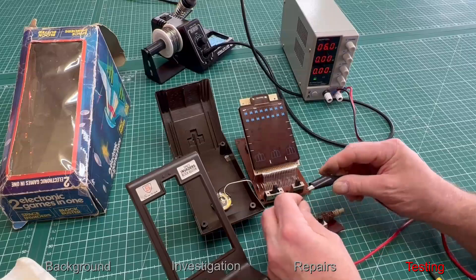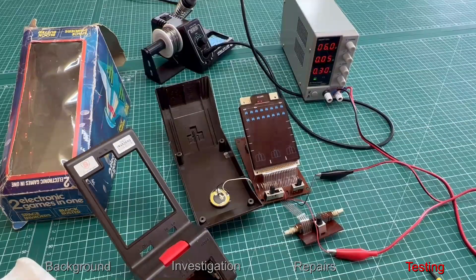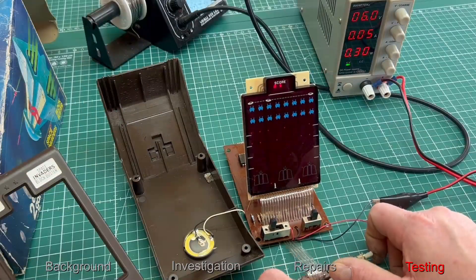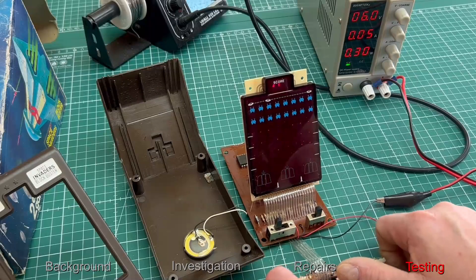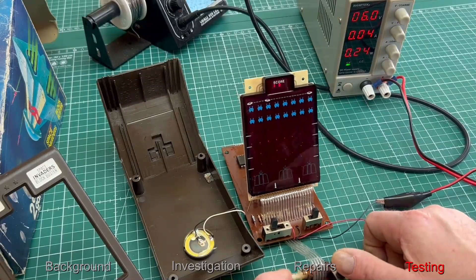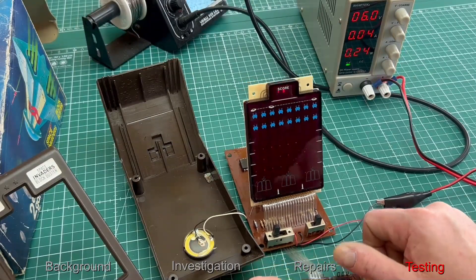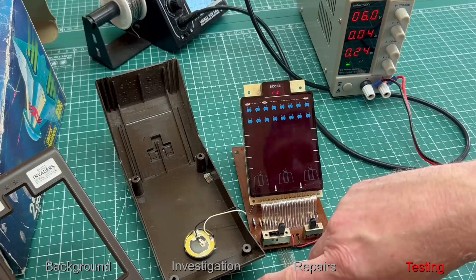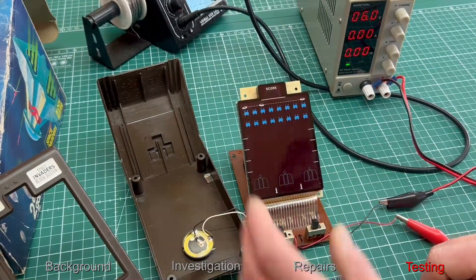Let's hook up six volts — it's four times 1.5V batteries — so we're going to apply 6 volts, turn it on and see what happens. I can see the scoreboard display has come to life and all the matrix dots appear to work. The little paddles either side move left and right and the fire button works. This is game one, the Space Invaders game. Let's try the second game — the blocks game. Moving it into the second position, the bottom dot becomes a double dot to represent the paddle, and pressing fire shoots a ball up which knocks the blocks out of the wall. That all seems to be working correctly.